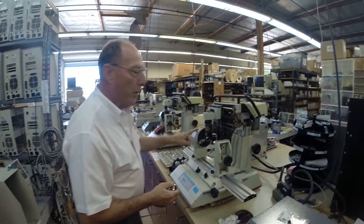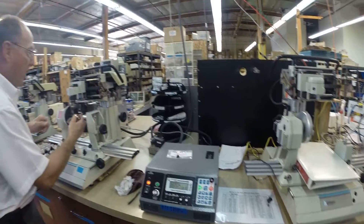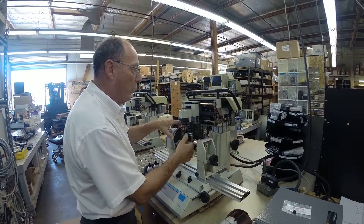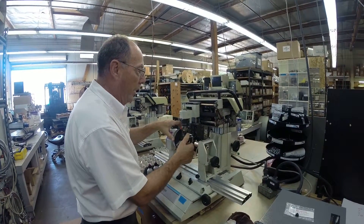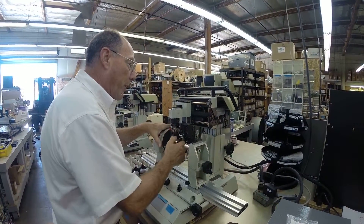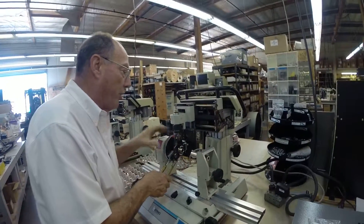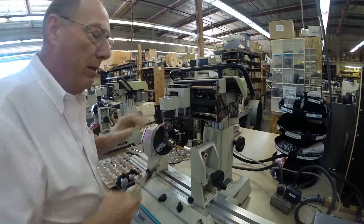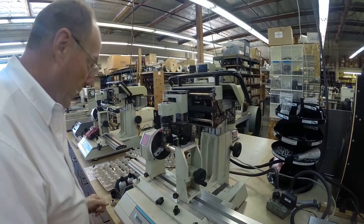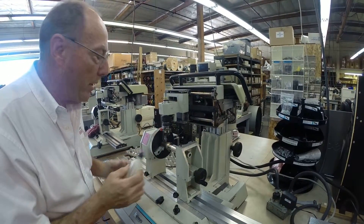I've got an orbiter here with a Q3E controller running it. And I've got just a portion of a spindle — a cut-off portion of a spindle quill — that I'm going to wind this onto. Because we're engraving pretty harshly into this, it does need to be tightened. This is just a soft jaw pliers. Slide this over. Tail stock support. And I'm going to take some ProTap cutting fluid and just run it around it.